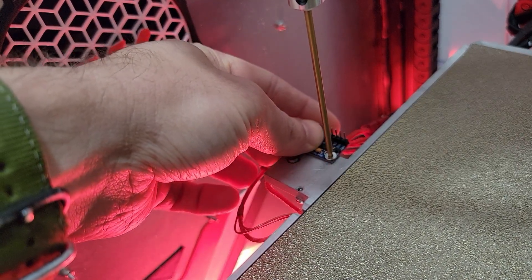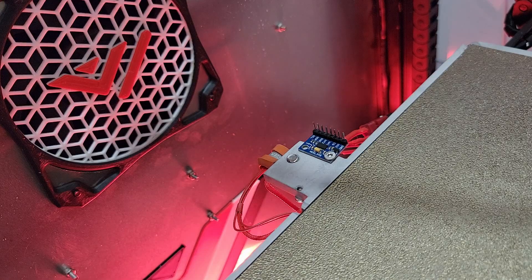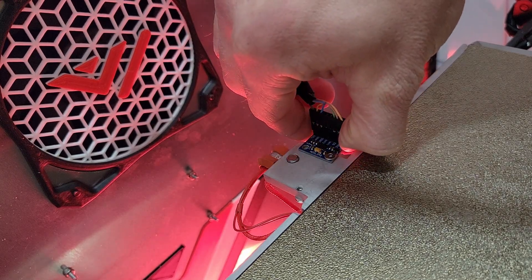I did, of course, measure the printhead, but never the bed. And I think it's as important to have a stable bed as it is to have a stable printhead — because even if your top gantry is CoreXY, the printhead is on top, and if the bottom is also shaking on the bed, you're going to get the same crazy artifacts even if you tune Input Shaper. So I decided to take measurements on the bed. I'm going to show you the results for both wall-mounted and not wall-mounted so we can compare.